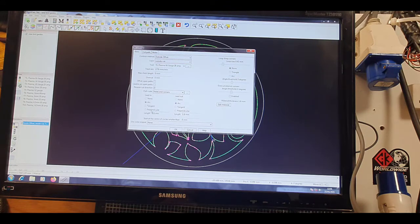This here, lead in and lead out, basically, you don't want it to pierce because you've got the pierce height, then obviously your plasma comes down to start cutting. If you don't get that right and you're piercing near the line, you're then going to get a blowout like a hole. Now, example, what you can do to make sure if it's a paying customer and the part has got to be bang on the money, I might even use lead in 4 mil. So which means that if we see in the cursor here, it's basically arcs. Now 1.8 mil, not so bad. I can pretty much grind that off if it's for myself, you pretty much not notice, but you can actually start from here. So the plasma will cut right in, then join, and then as it finishes, it'll join back out. So it's perfect. That's what that does.